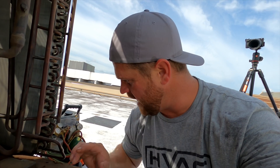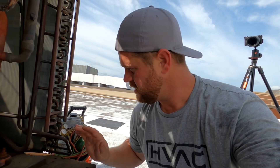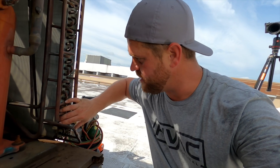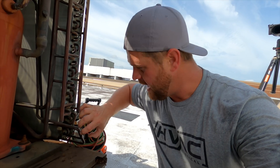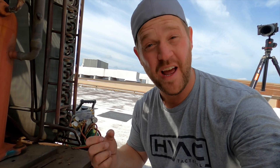After I tried to cut the metal out of the way it was just too tight. I couldn't get in there, and I didn't want to disturb the other circuit on this system because it's still full of refrigerant. So what I decided to do is just pull the corner of this coil out from the base a little bit, get up underneath there, push the fins out of the way, and I could see the little crack. So now I'm going to go ahead and get some nitrogen and get this brazed up.